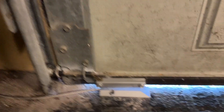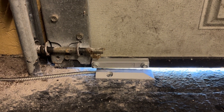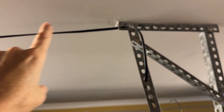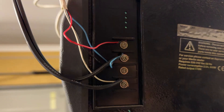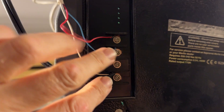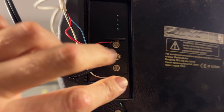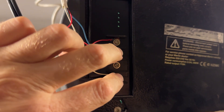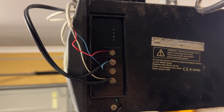Just down here I've put in a door position sensor which should be able to show in the app when the door has been opened. Then there's some 12 volt cable that feeds my normal key fob up the top. All I was interested in is these two terminals which complete the circuit. Remember I have this as dry contacts, not 12 volt active — so that's just going back to my Hub Mini. When those two terminals' circuit is completed, that's when the door actually opens.